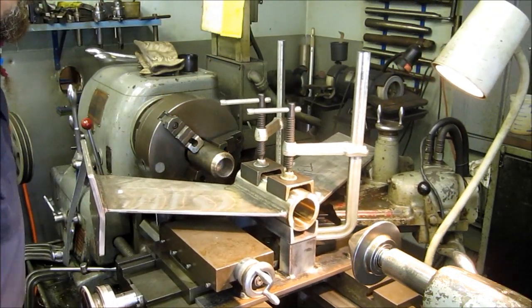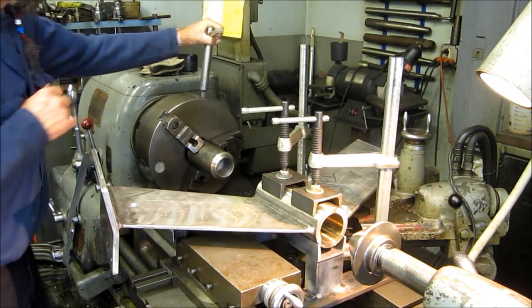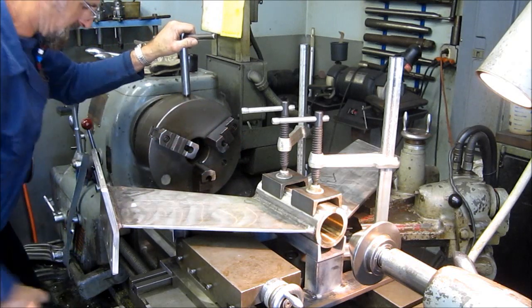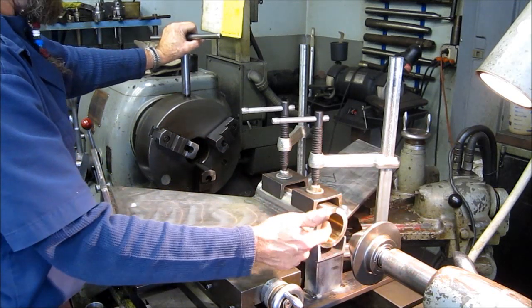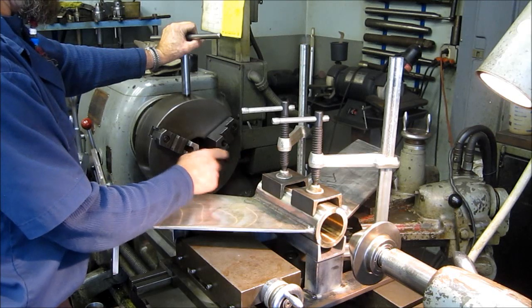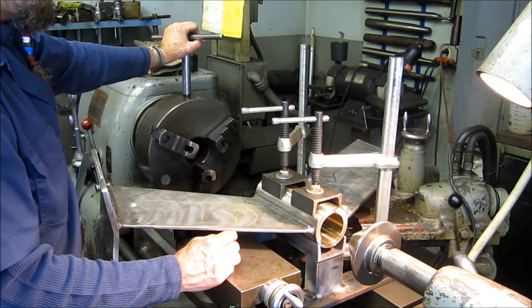And we're holding the strut for a line bore. Now we can start figuring out our bar, get our bar set up. We're going to hold our bar in the chuck, and we're going to change this out to a regular center. We'll be supporting the boring bar over there, and then we'll spin the tool bit and then adjust the tool bit for the diameter of the bore until we get it to size.